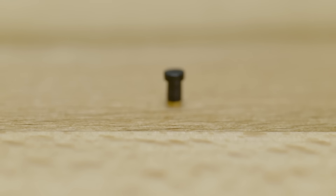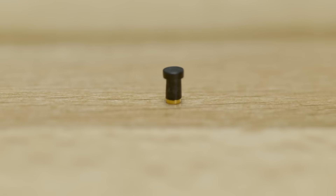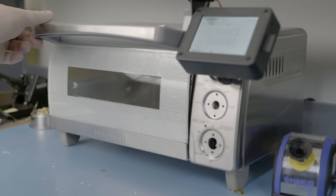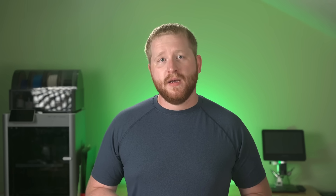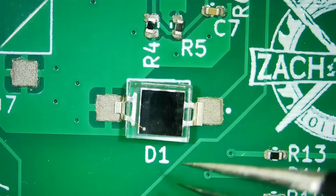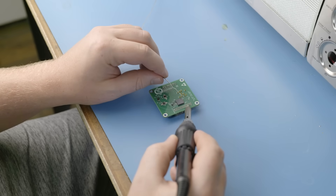Now that we know what's going on here, let's get this populated. The pogo pins I purchased come with little plastic caps on them so that a pick-and-place machine has a flat surface to grab onto. I'm 99% sure that these can withstand reflow temperatures, particularly for the low temperature solder I'm using here, but the datasheet doesn't give any information on these and I'd really hate to be wrong about that, so I'm going to pop one in the oven all by itself and see what happens. Okay, as I expected, it looks fine. A quick stenciling of solder paste, throw some components on and into the reflow oven they go. Finally, I'll solder the header connectors on by hand.